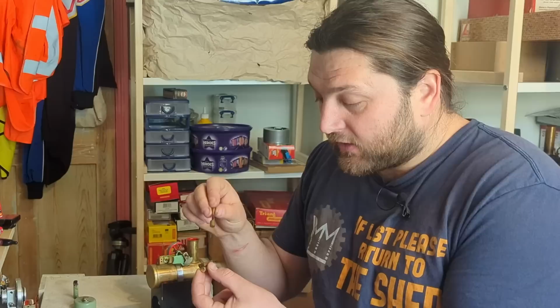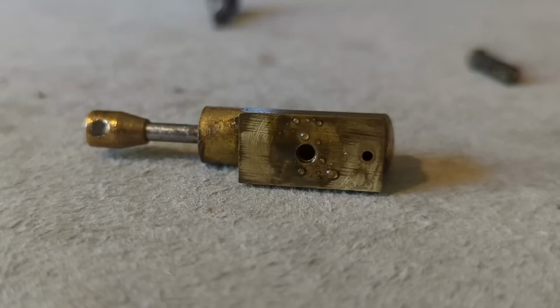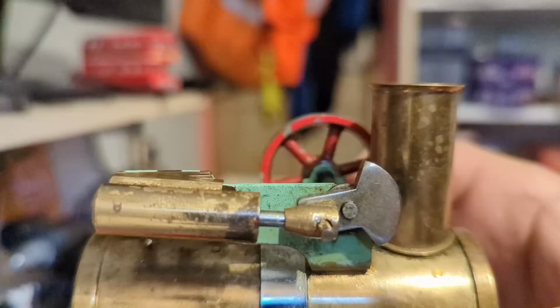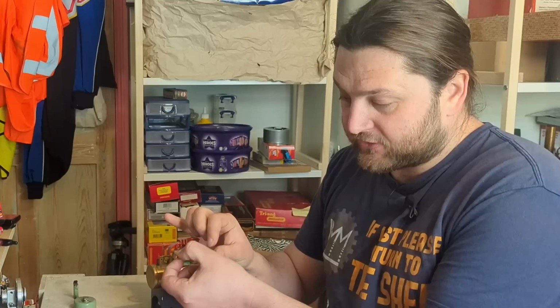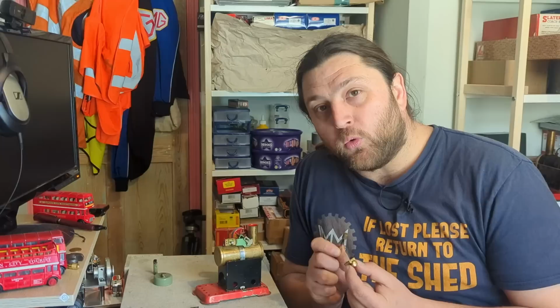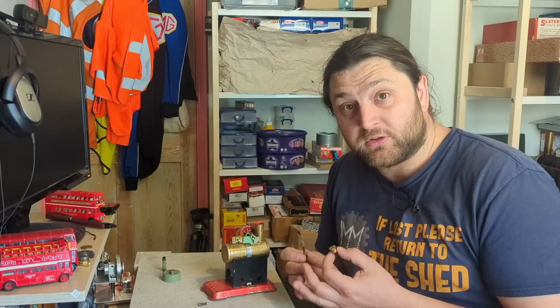In the up position, it lines up with that hole there, and that hole pushes steam from the boiler, which causes this to push forward, and that spins the crank to that position forward at max expansion. At this point, because of the pivot, the face moves and it comes to this point here, and at that point the steam is able to exhaust out. Now, all things want to at all times return to their base state. So pressurized steam wants to escape to wherever you let it go because it wants to go back to zero pressure.